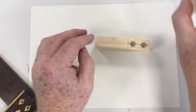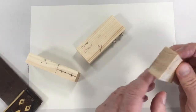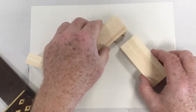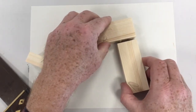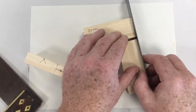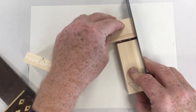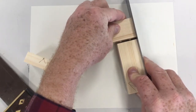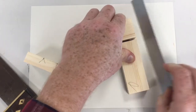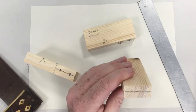So you would take your other piece of wood, again facing edge up the right way, so there's your edge against your edge and your face up. So you line up your wood, okay? You could use your rule, some straight edge along here to make sure it's straight this way, and then hold it flat on the table. And all you're going to do is push those 2 together, right? Just push them together, and what will happen is the dowel pins will make 2 marks.